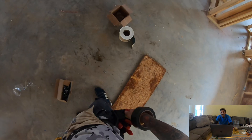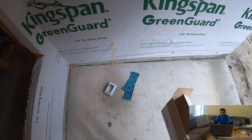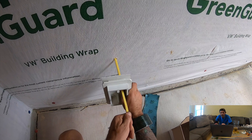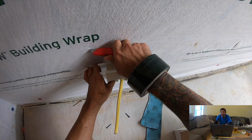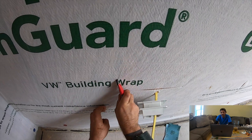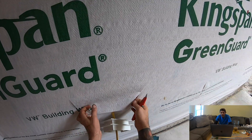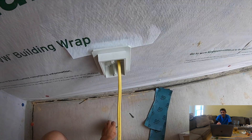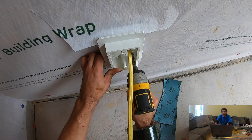These blue pieces are the flashing for the pancakes. If you have vinyl siding you're going to need octagon boxes, which is a little different. Carrying a garbage box around with you makes things a lot easier because when the wind starts blowing it'll pull those little paper pieces all over the place. I put the box on just a little bit just to see where I need to cut that top line, and then I do the two cuts on the angle.